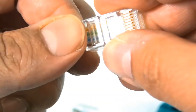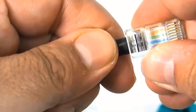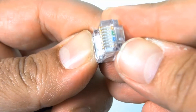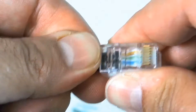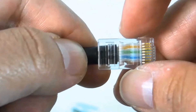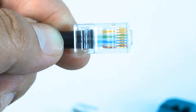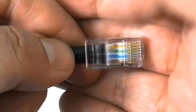It's a little bit of a chore and it's also a little hard to see the connectors. About half inch is what you want to cut it to and slide it in there. You can take a look to where the conductors get pretty close to the end, and the jacket itself is going to pass that little crimp area. It's hard to see the conductors there sometimes.